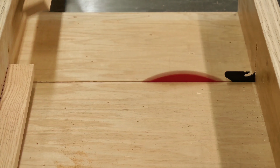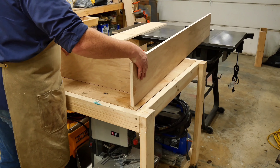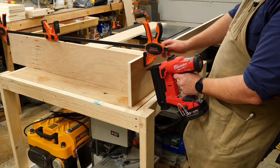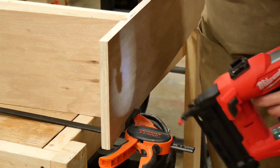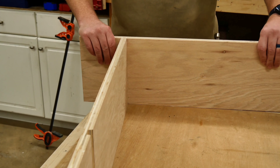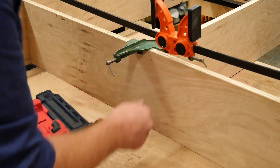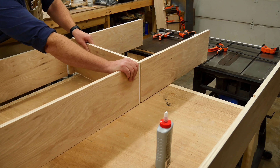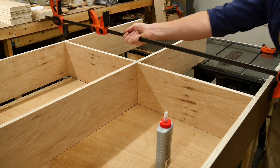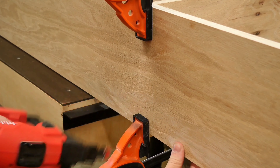Once those pieces were cut, it was time to start the assembly. For these shelves, just like the past couple projects I've done, I'm using glue and brad nails to assemble them. First, I applied some glue to the lower dado slot, then I clamped the bottom shelf into place and drove in some brad nails. I then repeated the same process again to secure the other side. With the two sides secure, I attached the middle support piece into the slot on the top face of the fixed bottom shelf. Then I slipped both of the fixed middle shelves into place and began to secure them as well. For these, I just drove brad nails in through the outer sides and then I clamped them into place and left them overnight to dry.